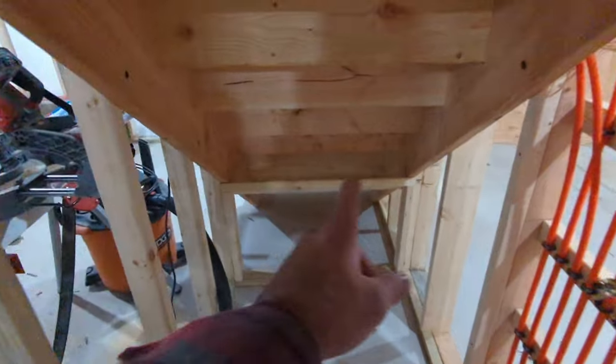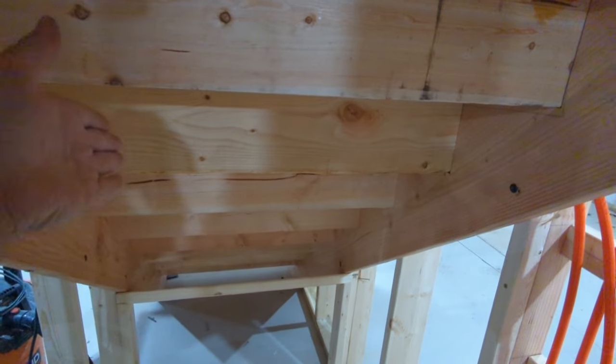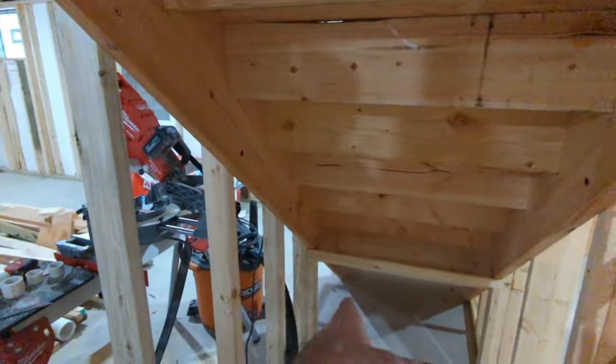All right, I got this frame at the end of the understairs closet, I guess it's going to be now. I'll set two 2x4s onto that, kind of like rafters or something. I don't have to worry about the other end of them. I guess I could put an angle on the other end of them. And then I put this ledger up here with this angle of the staircase on it, so these will have a plumb cut the way a rafter tip does. And so, yeah, I guess I'll plumb cut the other end of them, so the far end from here, the other side of this wall's thickness back here, 2x4's thickness, I guess we'll swing right up the end of that.